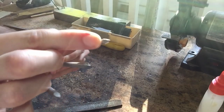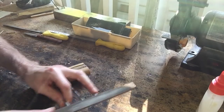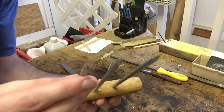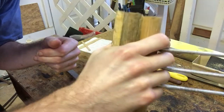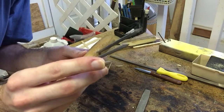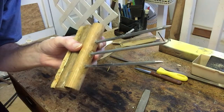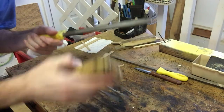So what I want to do next — and I probably should have done this earlier — is sharpen these nails a little bit, because as you can see they're a little dull, so I want to make them sharper. I'm going to do it with a hand file. Once you're done sharpening these edges, next you're going to want to sand this down because it's a little bulky and blocky. I'm going to use a belt sander to round this off. One more tip: if you do sand these nails down to make them more rounded and sharp, I recommend doing it before you glue them in — it's a lot easier to file one nail at a time separately than to do it after assembly.